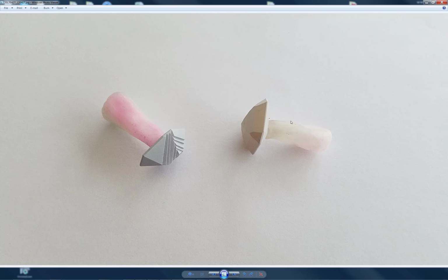Now, you have to prep things that are transparent, that have subsurface light scattering, or that are highly reflective. So what we have to do is coat them. There are different ways of coating it. I happen to use an airbrush system, which I find gives finer control, and it allows me to really fill in areas more accurately when prepping a model or a stone for scanning.